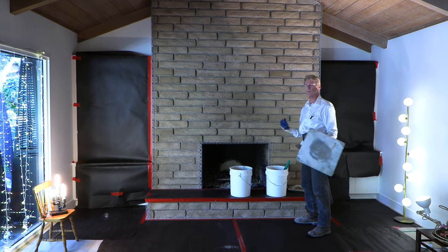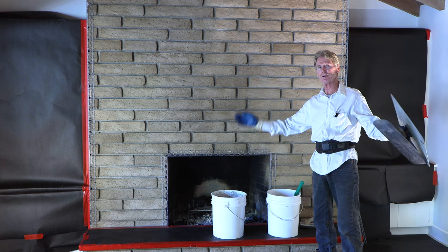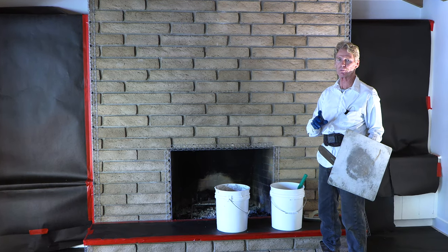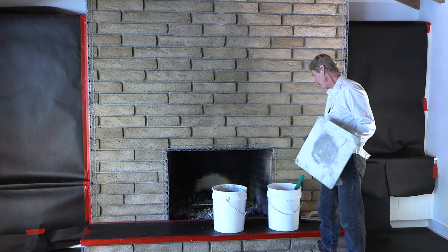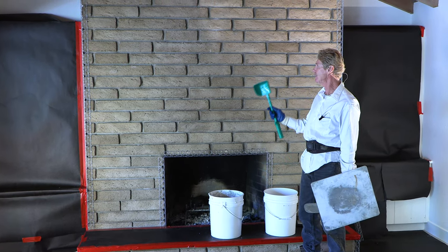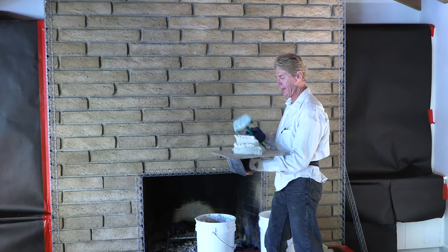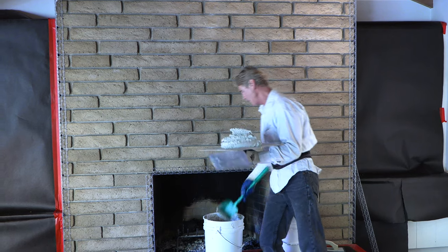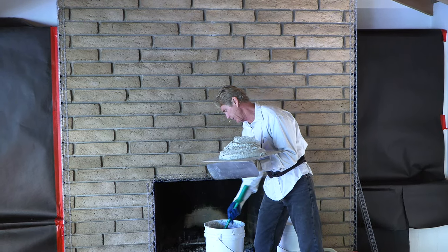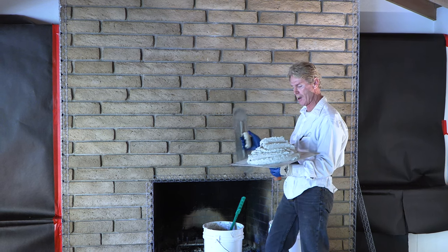If you homeowners are doing this, you can just do a base coat and stop, then come back another day or a week to do a finish coat. But we are doing base and finish on two different fireplaces, plus surrounds and other things. We do things same day — it makes them stronger. So I have some Echoplast and we're trying two scoops of calcium formate. I'm looking at how fast it sucks up, with the heater on and all that.